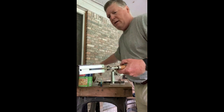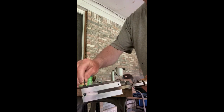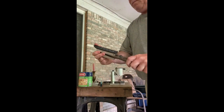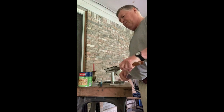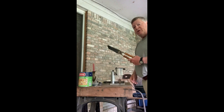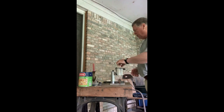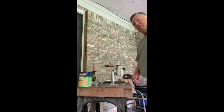I'm also going to take my allen wrench — I don't want to tighten these up too tight, but I do want them snug. While we're waiting for our lead to melt, this is a good time to preheat your mold. I highly suggest preheating your mold — it'll save you a lot of hassles. It's simple: just set it on top of the pot, and while the lead's melting the mold will be warming up.